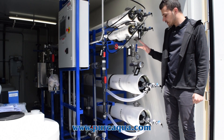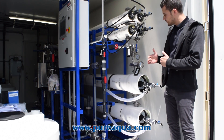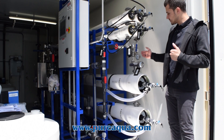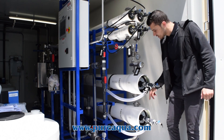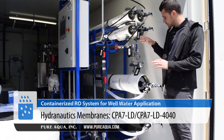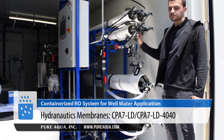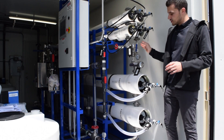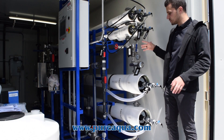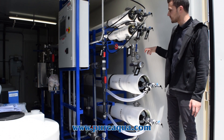To achieve 80% recovery with a balanced flux throughout the membranes, we've opted for four element-length stages. This is our first stage, second stage, third stage, and fourth stage. As shown here, we're using eight-inch membranes in the first and second stage and four-inch membranes in the third and fourth. This gives us a better balanced flux when we run our projections and analyze the system design.